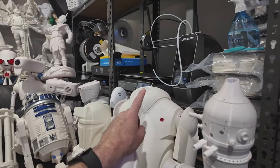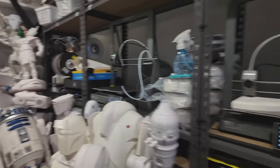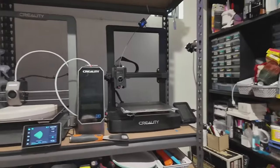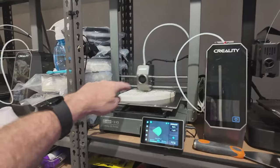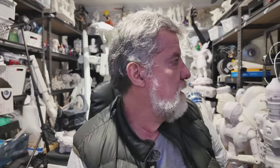The noise you can hear is when it does the gyroid back and forth — it makes that little vibration sound, a bit annoying. But you want it to run that fast, it's going to put up a little bit of noise. If you were to use a grid pattern or something I don't think it would make that noise, but I prefer the gyroid — I think it's a bit stronger.